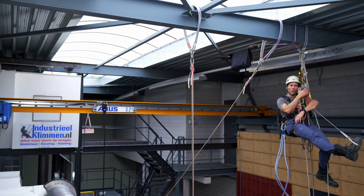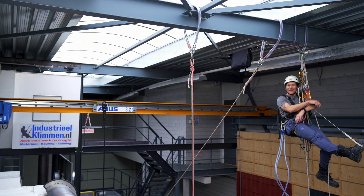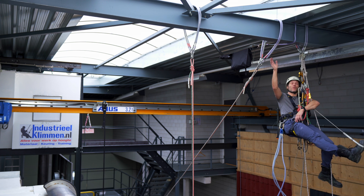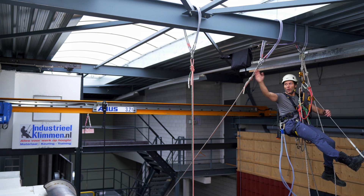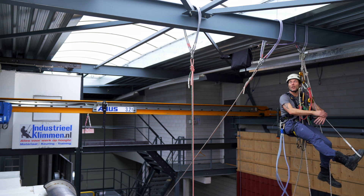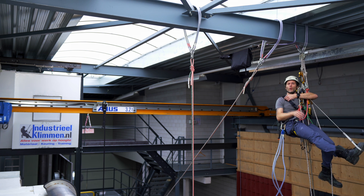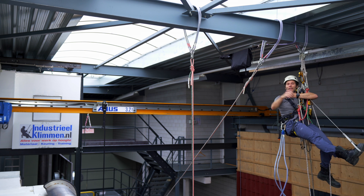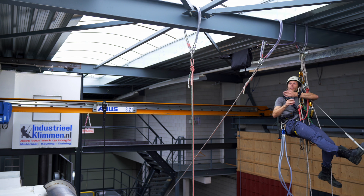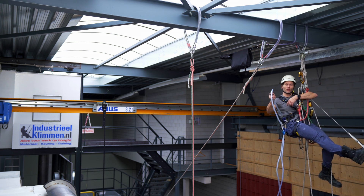So let's say we've been working over an opening - there's my exit. I have this beam, I've been working down here and I need to climb alongside the beam so I can take all the gear with me. I'll leave the ropes for now, but for the practice I need to climb alongside this beam. Along the way I'll have a few points where I can't slide the anchors through. We could use beam clamps and just slide all the way through, but we're going to climb with movable anchors and we'll be using steel slings for that.